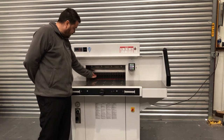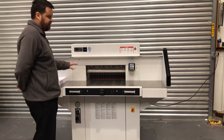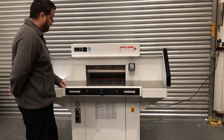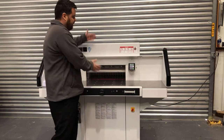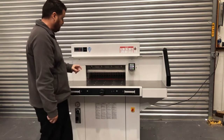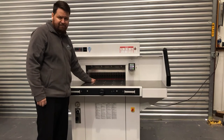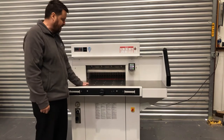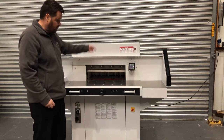Because the machine is one of the professional models, it also has a false clamp plate and a foot treadle, as well as the intelligent safety curtain on the front. The machine will cut a 560mm width, a 570mm depth behind the blade, and will do a 90mm cut height as standard, or 95mm if you remove the false clamp plate, which simply clips out from the two slots and goes into the holder on the back of the machine.